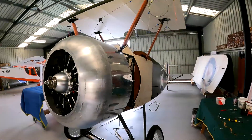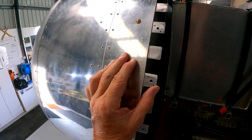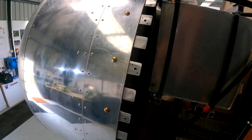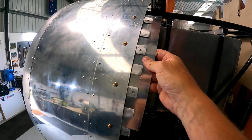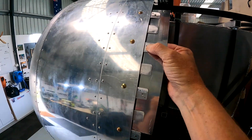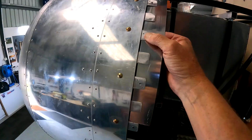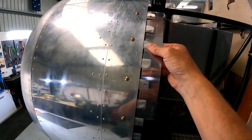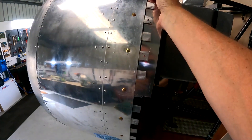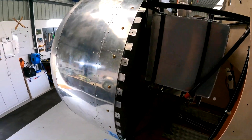Right, back on the Camel. Now I've just drilled these for the anchor nuts. I had trouble on the other side where the tangs can - see, they can just push out of the way. So I'm considering redoing the other side and putting a one-inch strip behind all of those, and riveting it with the anchor nut rivets. It means it ties all the teeth together. A bit more work and a redo. I just need a one-inch band from there right up and over to the other side. It'll make it a lot better.